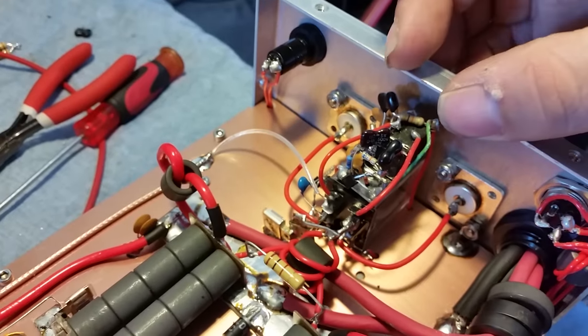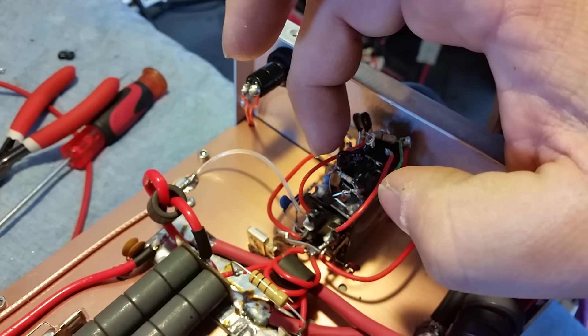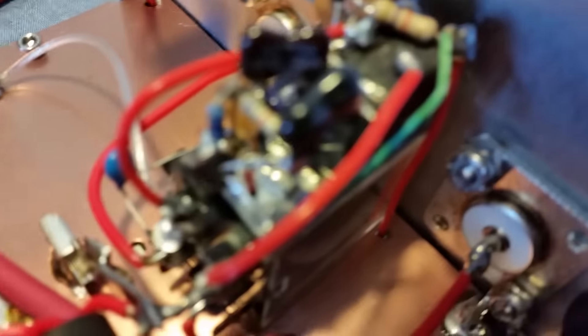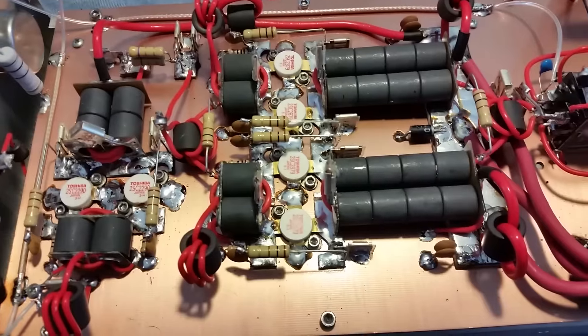What that invert circuit does is when it sees RF trying to come through the box from your radio, it'll literally invert the power, turning the relay off temporarily as long as that RF is on the sensing circuit inside the invert circuit. When you let go, it comes back on — same thing for sideband. As you can see, the preamp is on. I'll key now — that's the relay of the preamp switching to the off position. When I unkey, you'll hear it come back on. That's a nice little invert circuit I'm going to start utilizing on each build I do.